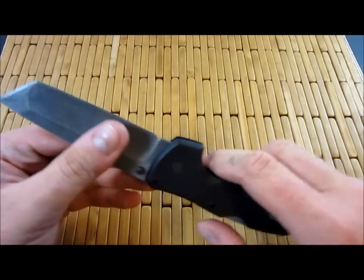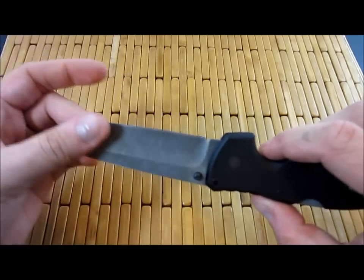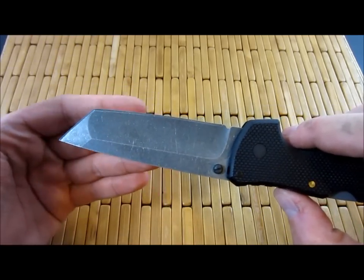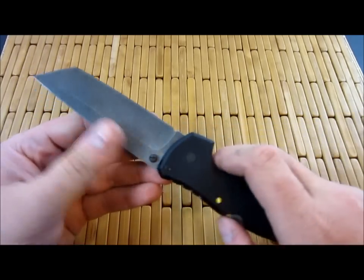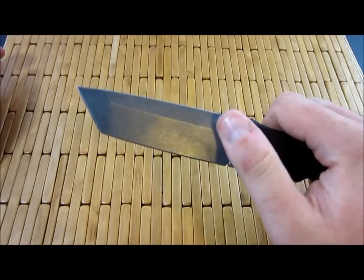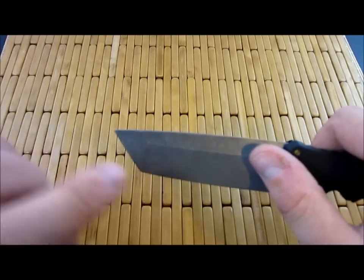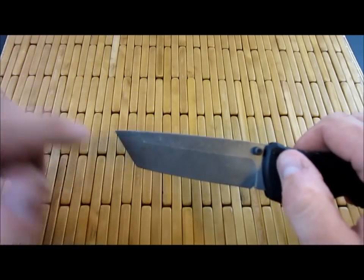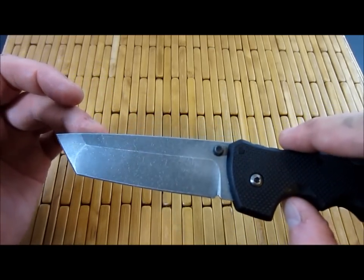Real easy to do. What's cool and not cool about it is the etching surface deposit is actually very weak — it's not very strong. It comes off pretty easy. So that's bad because if you don't want the stonewash look or the weathered look, you'll get spots coming through of steel. You'll have a nice dark gray blade, and then on spots that maybe rub, or if you ding it on something, it'll just immediately show through with shiny steel.